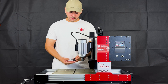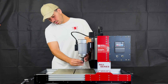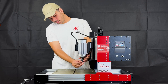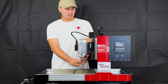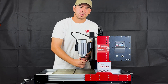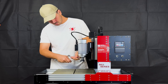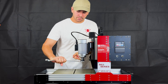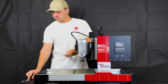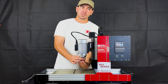We can connect our end mill to the Red Series with its collet and cap. I temporarily fix it by turning it by hand to get the gap, but this will never be enough on its own. For a secure connection, I perform the tightening process again with my 30-19 keys — make sure you apply enough force, in moderation of course. Finally, I check by hand that the end mill is secure in place. Perfect.